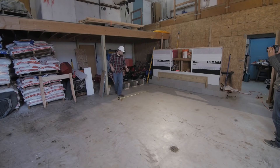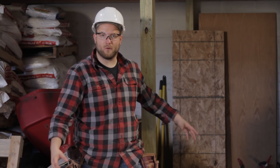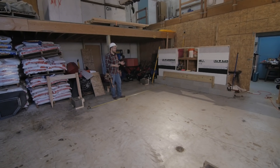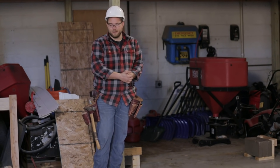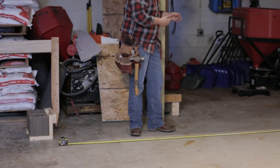One important point: you can see that my deck corner is going to be about right here. The reason we put these batter boards at least four feet off the corner is because our strings are going to be crossing right there and our post hole is going to be in that corner. If you put the batter board right on the corner, you won't be able to take your strings down to work and then put them back up to reference where your posts go — you'll have screwed up your layout.